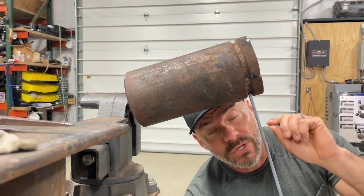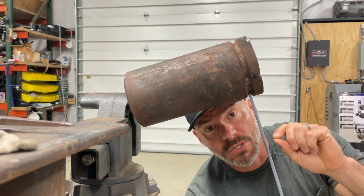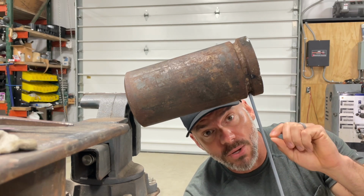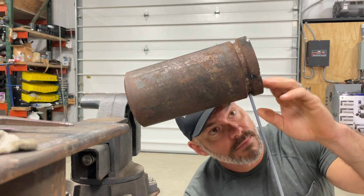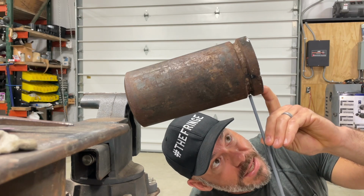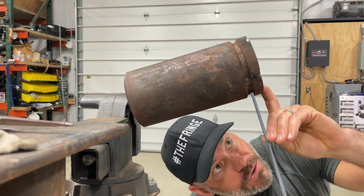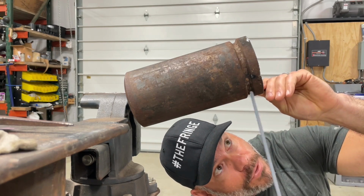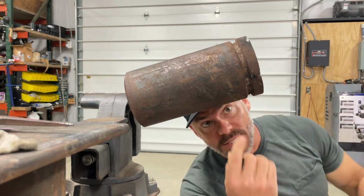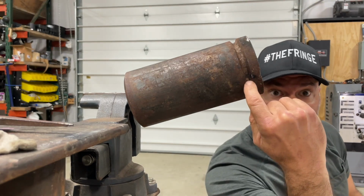The bottom is going to be thinner than the sides and the top because you're going to put too much in it and it's going to fall out and you're going to blow a hole in it and then it's just not good. So get kind of thin on the bottom. Just do something to get something flat in there that's not knotty and go all the way real fast on this side. You're kind of stepping out. So your hot pass should go about right here.